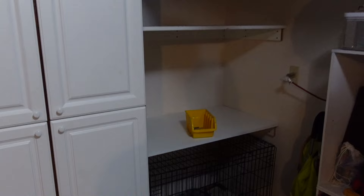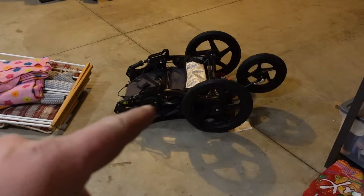That's better — ain't perfect, but it's also a garage, so not too worried about it. Pretty happy with how that turned out. Made a good little storage spot. I made this one tall on purpose because I want to be able to fit the stroller in there sideways, and the other section is still tall enough to fit that size bin, which we use a lot of. Now I'm just going to use the countersink, drill some holes, and use some inch-and-five-eighths drywall screws. Don't need a lot in there — just a handful. We'll get that done and move on to the final shelf.